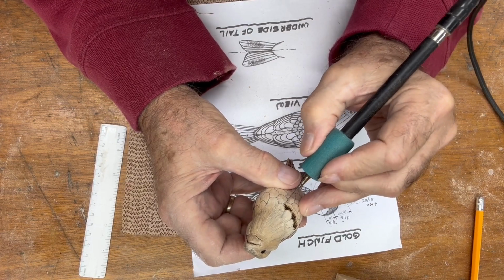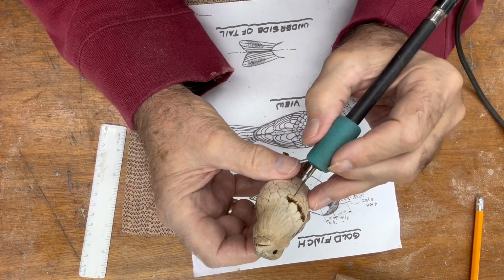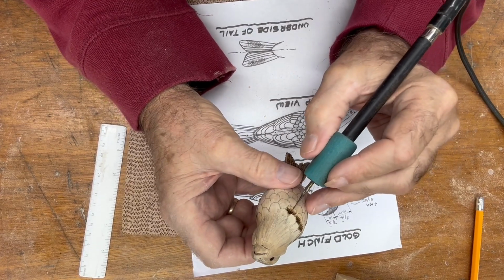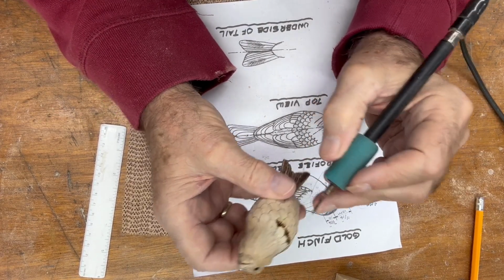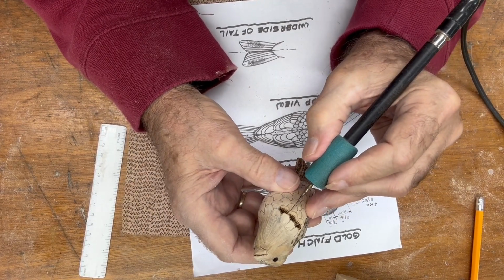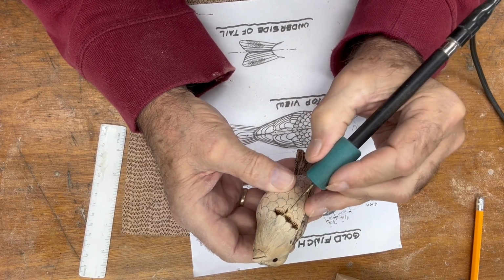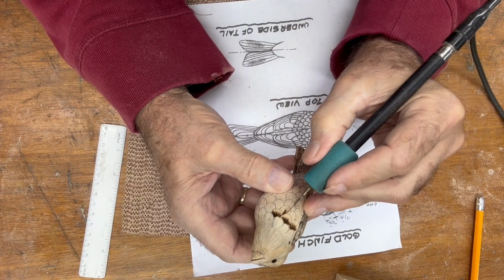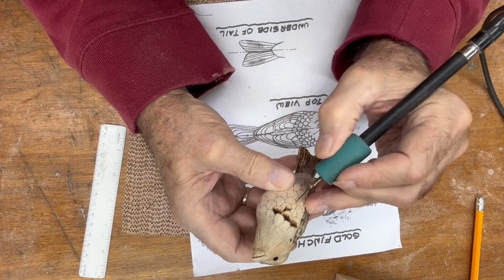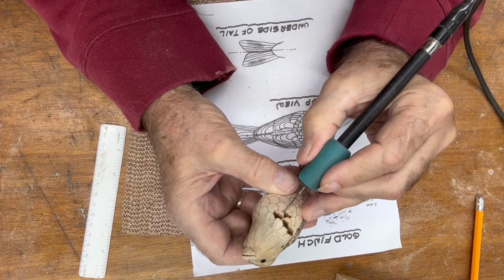And I'm taking that whole leading edge and burning it that way. And I'm actually textured all the way out here. If I didn't get it, then I could go in and fan to the left and fan to the right real fast. I don't want to drag it, because the first initial one is a hot one. Boom, you're in. Then you're flaring out to the left. And this takes some practice sometime, okay? And then you're flaring out to the right.